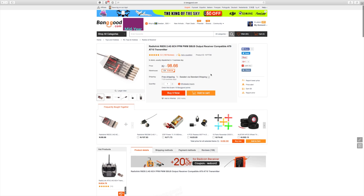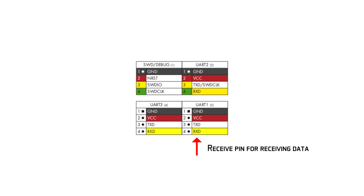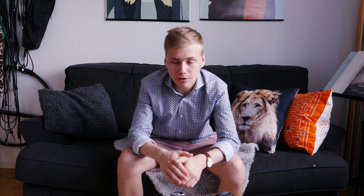You can remove any cables from the harness that you don't need. There's a third way of doing this — using the protocol SBUS. Some more expensive and newer receivers support SBUS. SBUS is a fully digital way of transferring your instructions from the controller, so instead of the analog signal used in PPM and PWM, it's digital — making it way faster and more reliable. If you have an SBUS-enabled receiver, connect the SBUS output to either a specific SBUS input on your flight controller (check the manual) or to one of the UART ports. Then in your software — whether it's Betaflight, Cleanflight, or something else — enable that UART port and set the receiver type to SBUS.